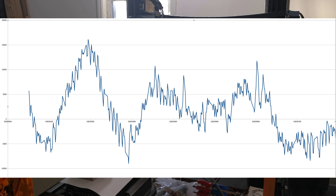If you look at this graph, this is about one second of data, and it's representative of what I see for the entire travel range. The x-axis here is the sample number — there are about 600 samples per second. The y-axis is in nanometers. There is a 2.5 or maybe 3 Hz fundamental vibration that is the largest we can see, and it's off the scale in the previous frequency plots. But there are significant vibrations at higher frequencies as well. Maybe the fundamental is caused by uneven pulleys or maybe binding in the screws — I am not sure. But this big deviation accounts for positioning errors of up to 15 microns.